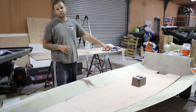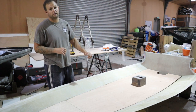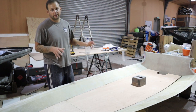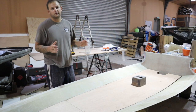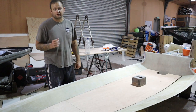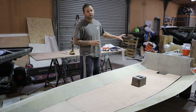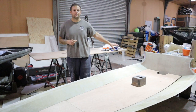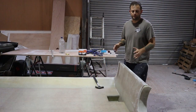On top of that, I've actually trimmed the outside lip now, trimmed all up and back around the transom as well, so we're moving forward with that. So once the deck has been bonded and laminated in, that's pretty much it. The only thing we'll have to put in is a tow eye, so we can strap it down to a trailer when the client takes it to go and get tubed, okay? And the only other thing we have to do now is create the tube carriers for the transom here, which we'll show you a bit later.